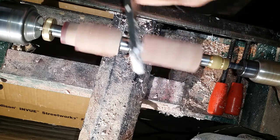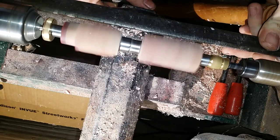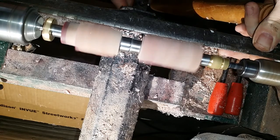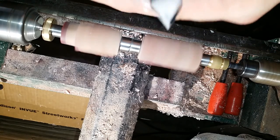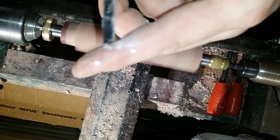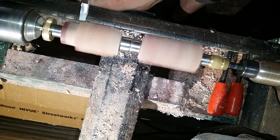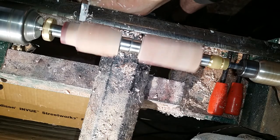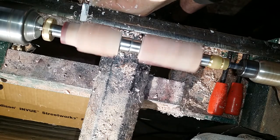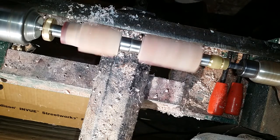I like to use a parting tool — you can do it however you want. I like to bring it down to size. If I put an edge on mine, I angle it upwards so that I have a real sharp point on the side. Small bites. It's vibrating, so we need to tighten it up.